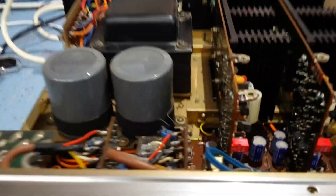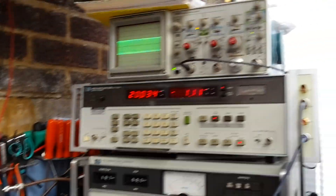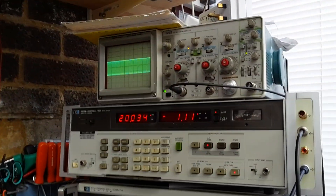So that's interesting — changing those capacitors in the audio line has made no difference at all to low frequency rolloff. Though I think quite honestly if I'd plugged that in and said, 'Oh yeah, that sounds much better, it's got much better bass,' it just goes to prove that the response of the amplifier hasn't changed at all.